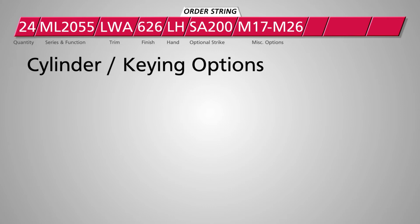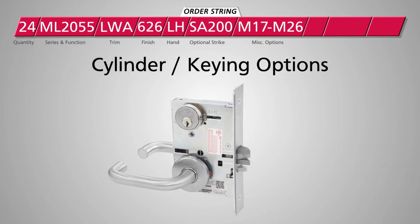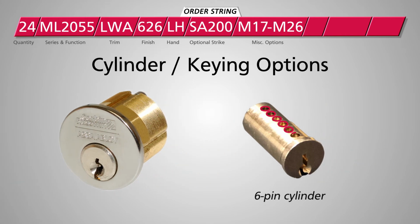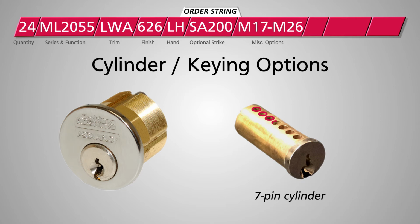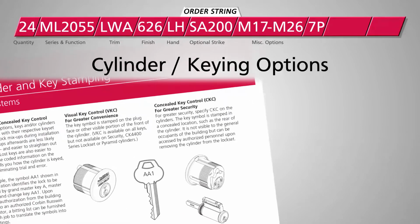Next, we'll specify cylinder and keying options. The ML2000 series lock comes standard with a conventional 6-pin cylinder. But since our project example requires a 7-pin cylinder, we'll enter the specification code for that option, 7P, here. We can also choose any additional cylinder and keying options.